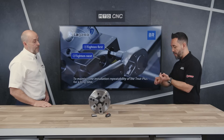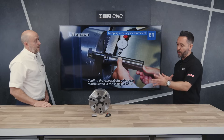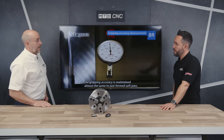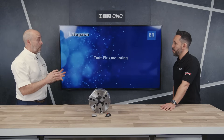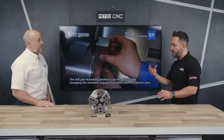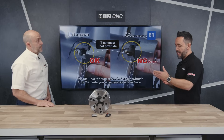So having that rigidity and that wedge system is essential. Yes. Now, looking at the chuck, you've improved the speed, repeatability, and accuracy. But what are the T-nuts on the table — what are they there for? That's another new innovation. We've taken the old T-nut and looked at how we can improve it. We've got new ground faces on the component itself, so that when you lock a soft jaw down now, it will actually hold in position. The T-nut plus doesn't move in the slot, so when you lock down it will give you great repeatability. So you can bore a set of soft jaws out, take them off, bring them back at a later stage, and we will actually guarantee better than 0.01 TIR — which is a big improvement. That's a big improvement in repeatability, and it also saves the machinist having to bore out jaws every time he's putting them back onto the chuck. It's simply making it a tighter fit — before, the T-nuts used to wobble around.